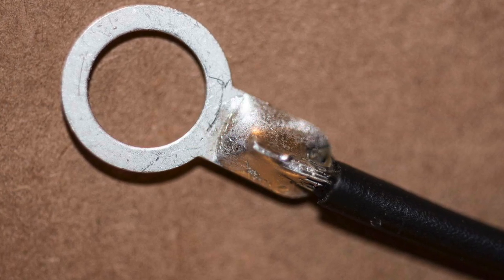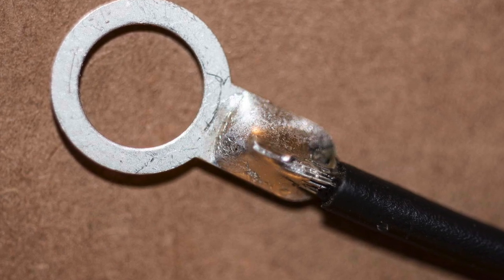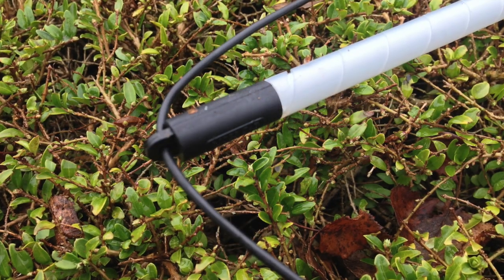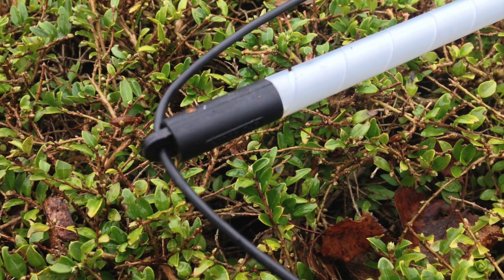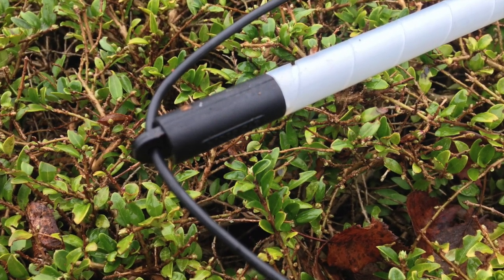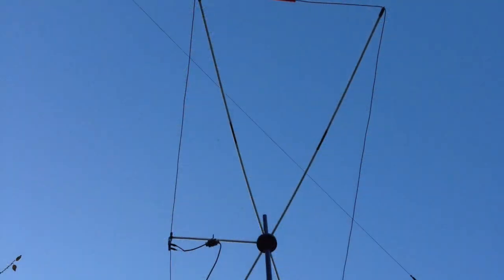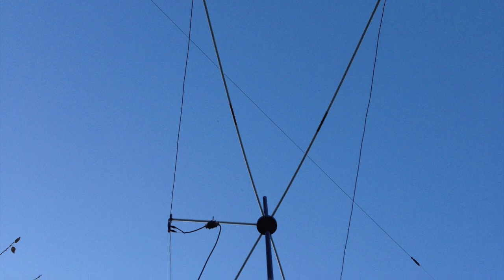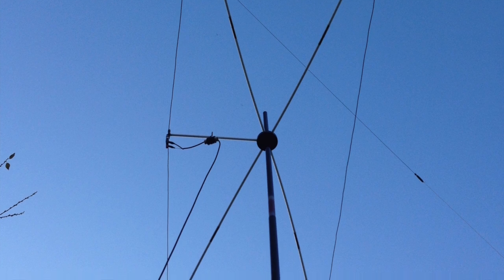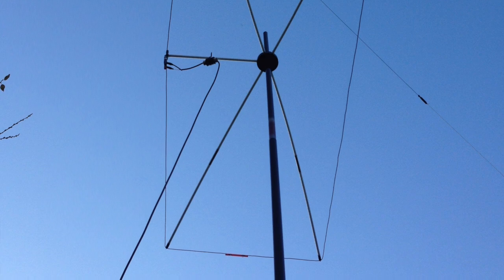There's not really that much to constructing the aerial apart from measuring the cable lengths correctly to make the elements, and you do have to solder a couple of lugs - fairly straightforward, as long as you've got a soldering iron and a little solder. Once the antenna is made, the actual putting-together time in the field is very short. Four minutes without rushing and I can have the antenna from the bag to completely constructed on the floor ready to go up, and in six minutes I can have it erected, coax connected, and hoisted up on a telescopic mast.